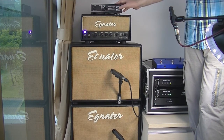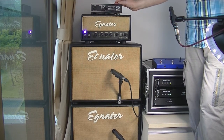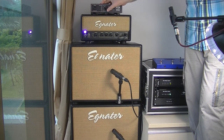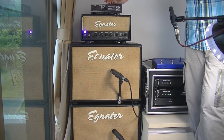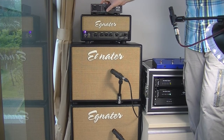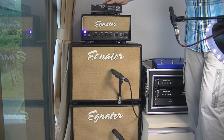That's why on top I have the Palmer Power Pad attenuator, which I've added bigger feet to. I'm running it all the way down on setting 5, which is 18% of full output. It adds 3dB of attenuation per click, so setting 5 is 15dB of attenuation. Bear in mind that 6dB loss is half the volume, so I'm getting between a quarter and an eighth of full volume. I'll demonstrate that in a second.